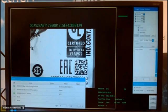That means my light is not good enough to read these kind of characters. I have only standard LED light, but for this kind of application you must have more diffused light, so that you have a more homogeneous light on your object itself, and then you can read it better.